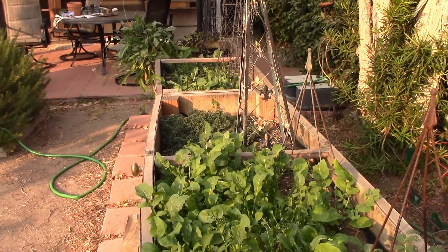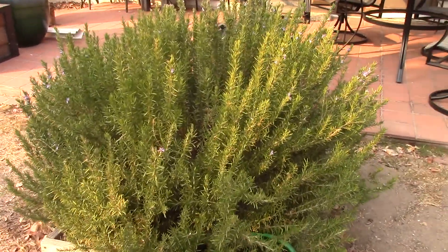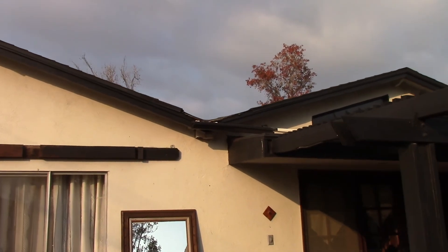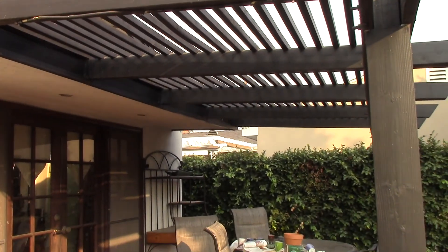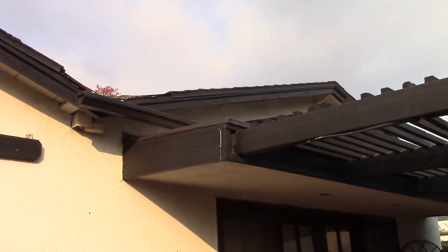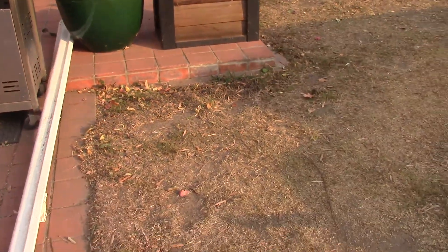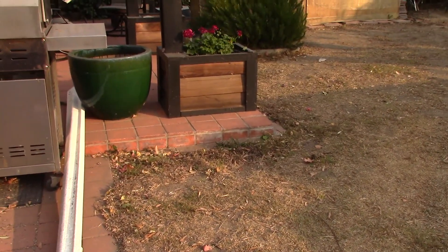It's a nice space — it's nice and high but it is starting to disintegrate a little bit so we're going to have to deal with that. Really lovely rosemary plant right here. Now we've got quite a big roof area which collects a lot of water. Most of it comes out this V right here. Currently there's a bit of gutter up there trying to get that water off to the side of the house, but there's not quite enough drop and it gets broken a lot, so the water ends up coming off this porch right in front of the door — which is not a good thing, it's causing some damage. There's also a drainage issue in that the yard generally slopes towards the porch and collects water right here when it does rain, so that's something we have to deal with as well.